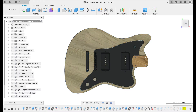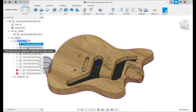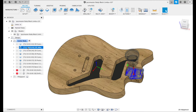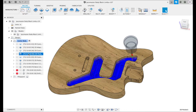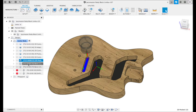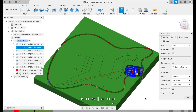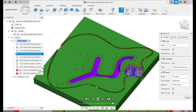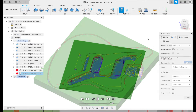Here's just a little bit of my process. I designed it in Fusion and then also did the CAM. I have a CNC router that I built and did all the machining on that, which you'll see footage of later. This is just going through the different tool passes — I did a lot of 2D contour and 2D adaptive. Here's just a quick simulation; I think the overall machining took roughly about 25 to 30 minutes with tool changes, though it shows 18 minutes there which isn't quite right.